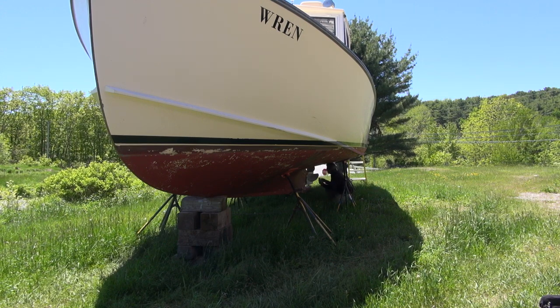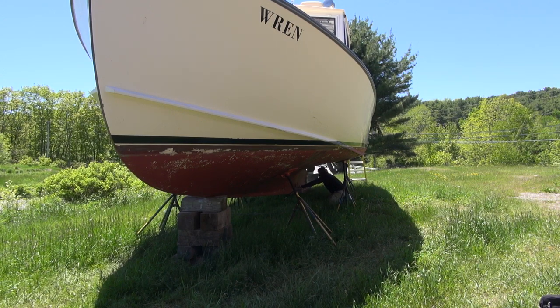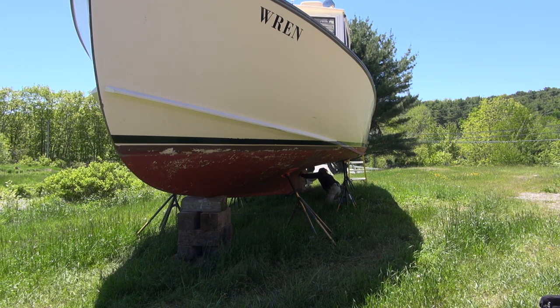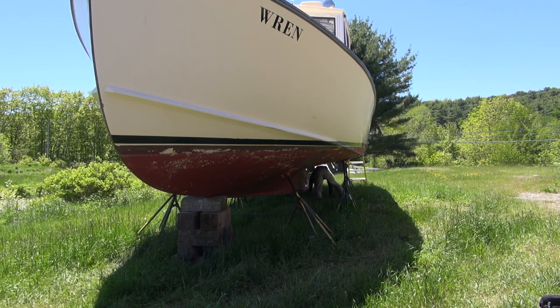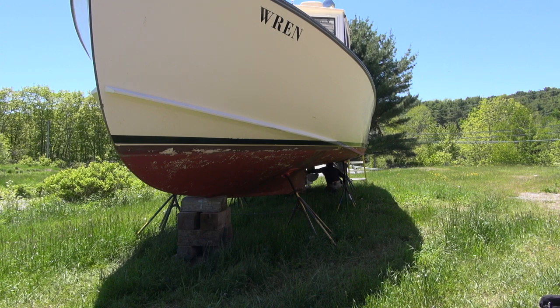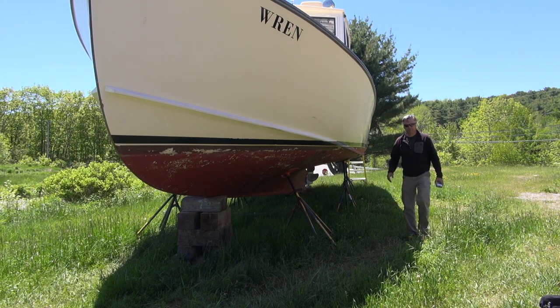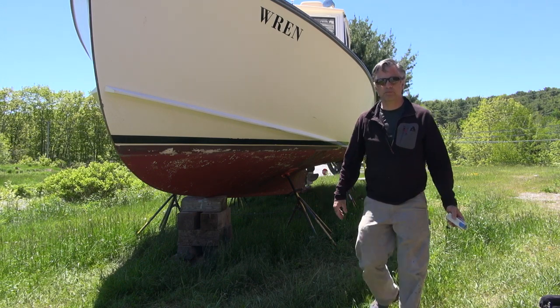Okay, now we're near the engine intake. It's got an eelgrass strainer on it. It's dry outboard, dry behind it, dry in front of it, dry underneath. Now I'm on the wet box, which probably isn't wet because it's got a tube. That's dry. Even near the bottom it's dry, where you'd expect it to be wet from water inside. Stern bearing is all dry. I can't check the rudder because it's stainless steel, not a fiberglass rudder.